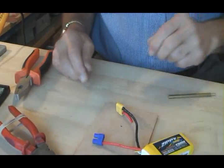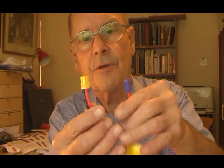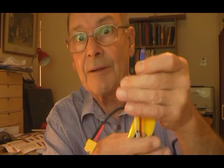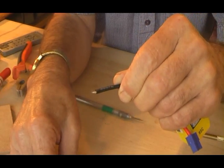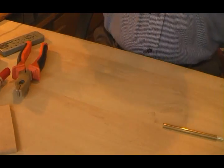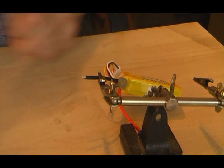So we're halfway there. We've transferred the first wire to this socket — like this they can't short together, nothing could happen, it's safe. All we need to do now is step through the other wire — the black wire — in exactly the same way. I've twisted the strands of the wire together first, then tin it.